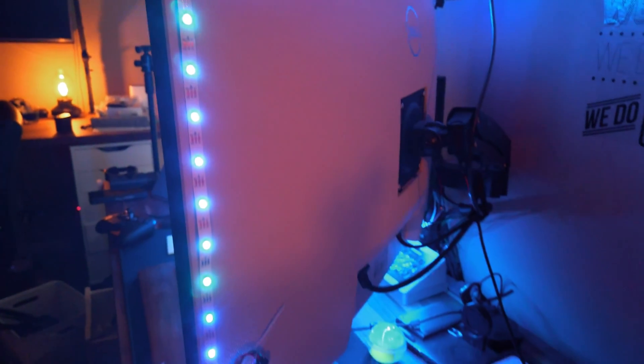For the monitor desk light behind me, I'm using a combination of the 100 LED per meter on the bottom with 60 LED per meter on the sides and back. Just design out what you want to use and select the proper densities. This is a tradeoff because higher density LEDs are more expensive and consume more power, so depending on the project you need to balance light output versus power consumption.